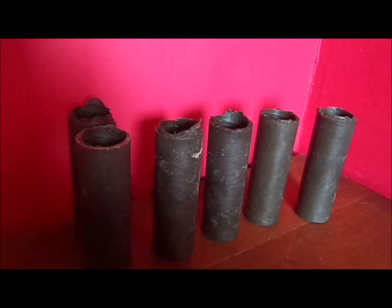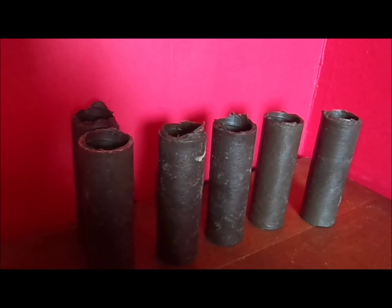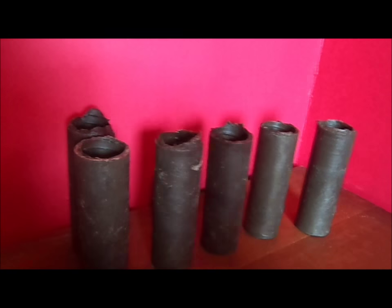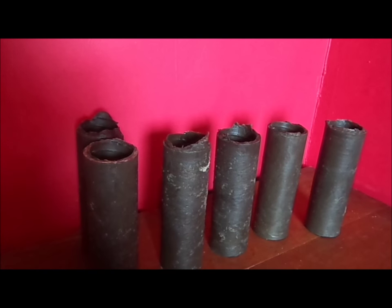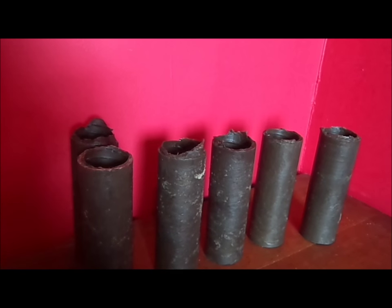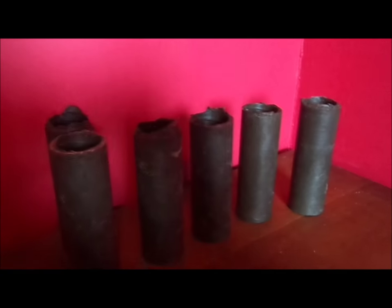I don't know if there's anyone who is making cylinders where the rough casting is actually twice the wax of a finished blank. That is, there are about 200 grams of wax in each one of these castings, and the finished blank is around 90, 95 grams.